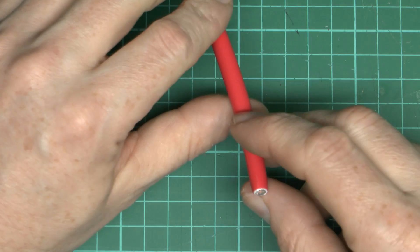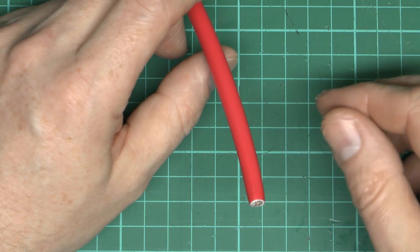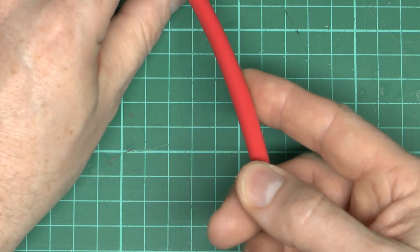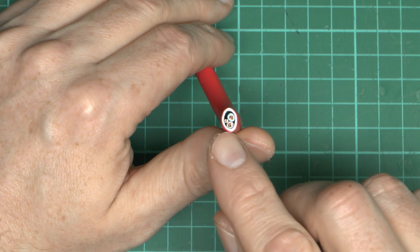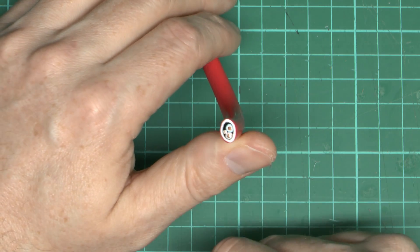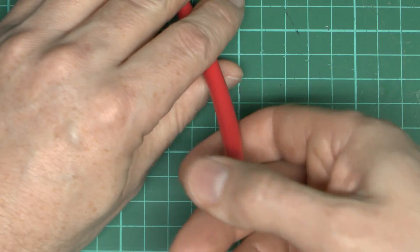So this is generally used in quite a lot of places. Let's have a look at this and how you would cut into it and strip it, and then later on we'll be testing out its fireproof properties. This particular one is red, a fairly common colour, because fire alarm stuff generally is, although you can also get white and possibly other colours. The piece we've got here is a 2-core and earth — two insulated cores and then a separate bare conductor for the Earth, or Circuit Protective Conductor, or CPC. You can get different numbers of cores and different sizes, just as with any other type of cable.